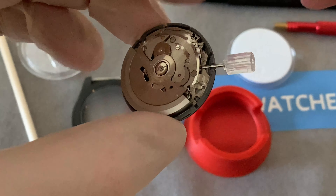So we now have a working crown - we can test it. Pulling the crown, changing the time. You heard that click there - that was the date changing. You won't really hear or notice that in daily use. If it bothers you, you could have set it to click at midnight, but you're not going to hear that. Nice operation, looks great. We'll screw the crown in now - I always like to screw the crown in at this point just in case I put some pressure on it from the sides when I'm trying to put the case back on.